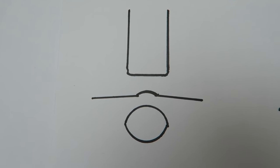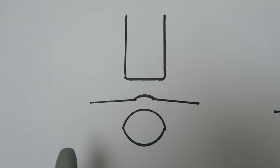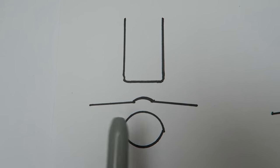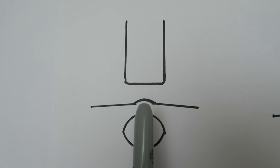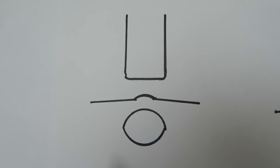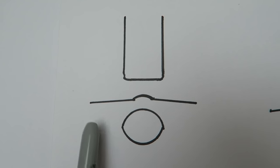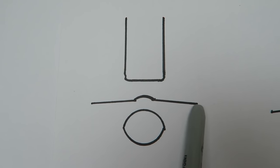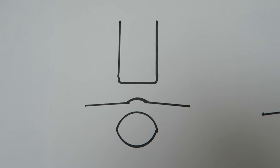We're looking at about moderate tension, I would say. You want to put the material through about 10 to 15 passes. You don't want so much tension on it that if you veer off the line slightly, you almost roll a second bead into the material. You don't want too little tension because you don't want to be passing it through 100 times to create the stretch required.